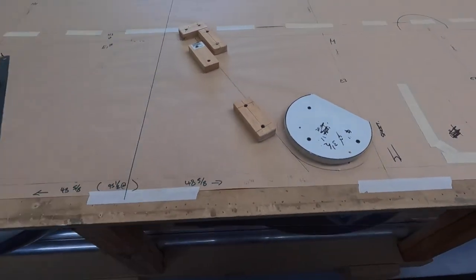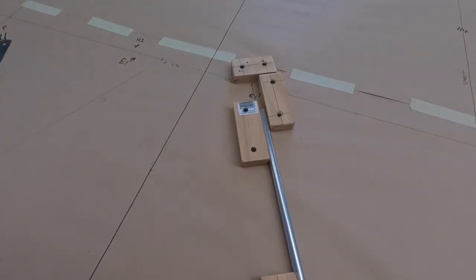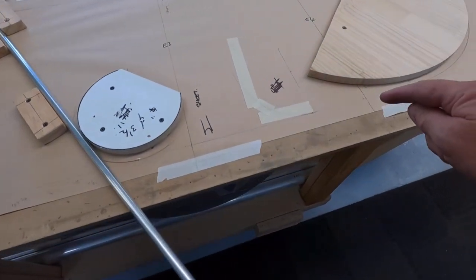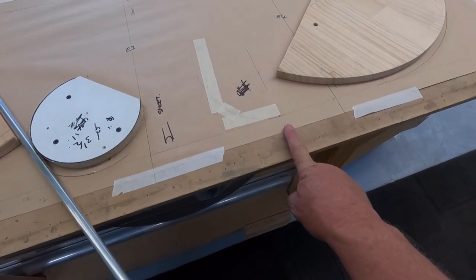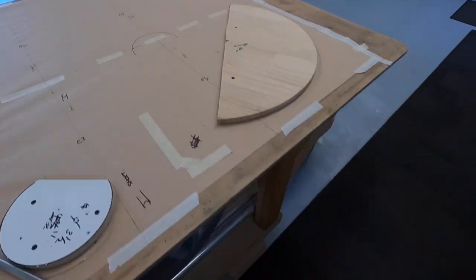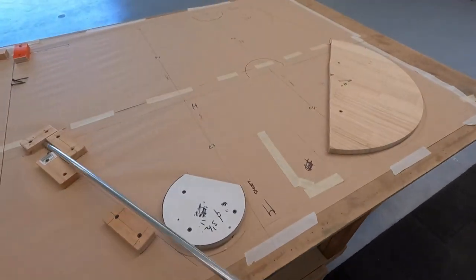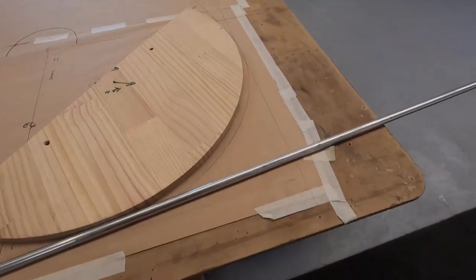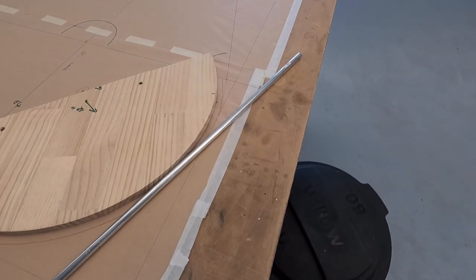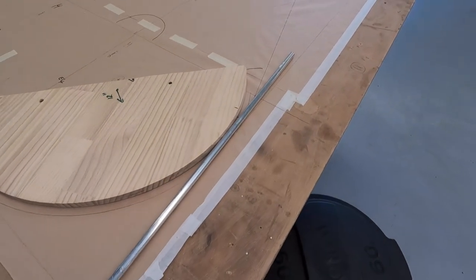Now I've got to make two elevators. This is the elevator trailing edge. You can see the material just sort of slots in. Bonk. Then I'll roll it around and come around here. I'll put another block there when the time comes, and then around the 12-incher and up to the spar. Just have to make sure you've got enough material to wrap it around. One thing to note: as this wraps around, you run out of leverage on the material. So you'll get to about there. I've only got about 12 inches, which we all wish we had, to fold that around.